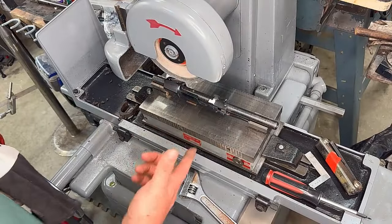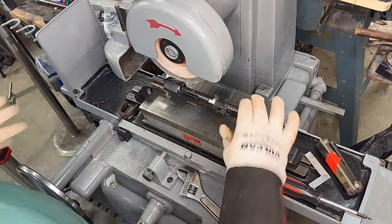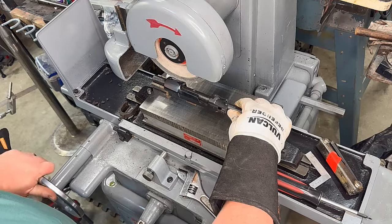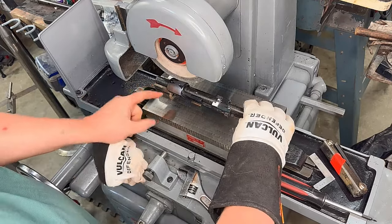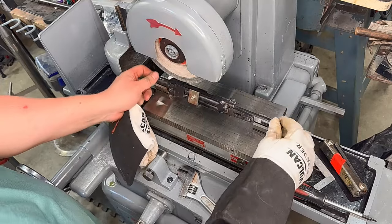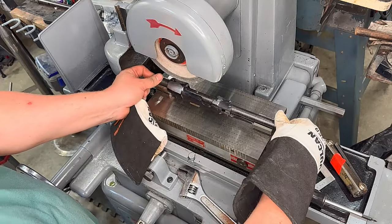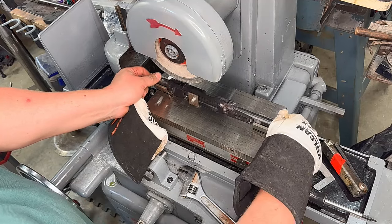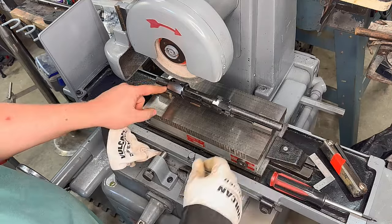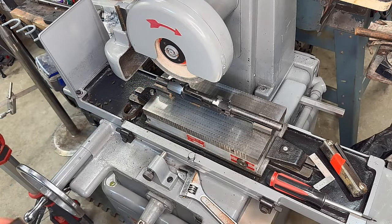I changed my operation around for two reasons: one, I'm right-handed so it makes a lot more sense to hold it here and move with my left hand, and two, now we've got a v-block in front of this right receiver all the way around. Before, the tang was what we were using to guide it, and if I ground past that there was potential it would slide back. Now we've got a stop here for the direction that the grinding wheel is turning.